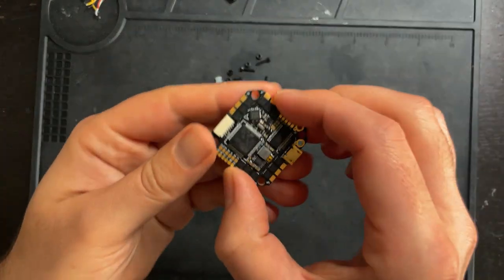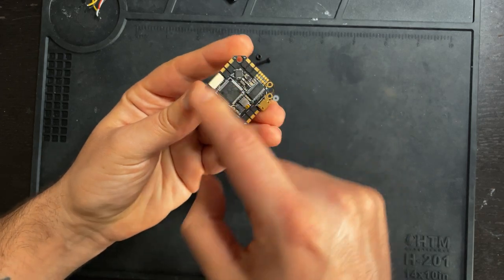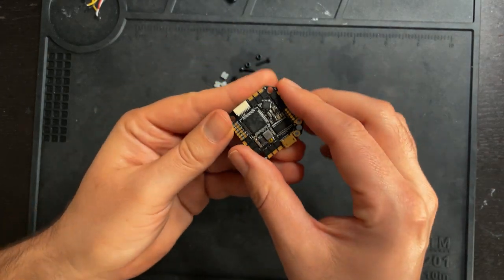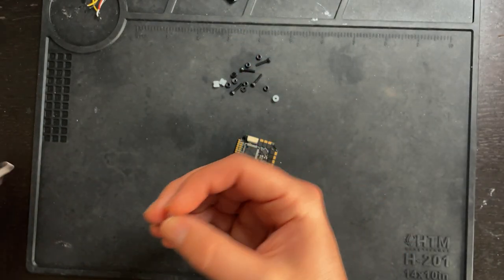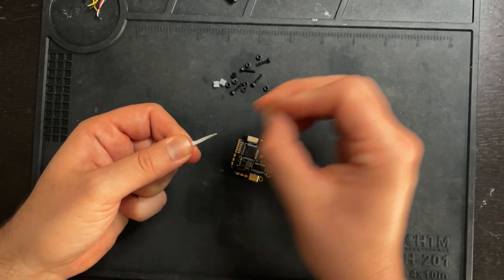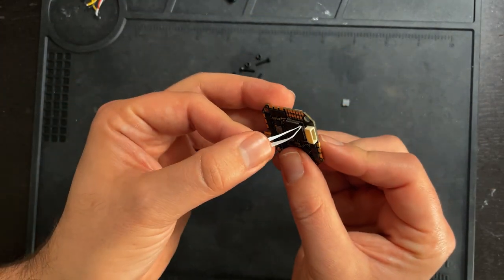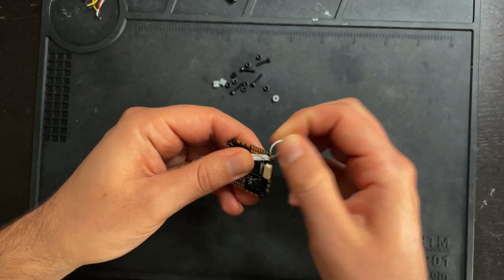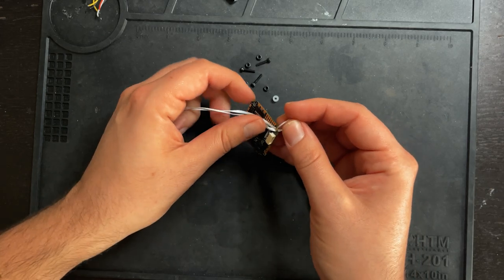First thing we'll do with the flight controller is get these little rubber grommets installed and do these three. Don't do this one yet because we're gonna solder the XT60 on here next. Little trick, I'm sure most of my subscribers know this by now because I include this on every build I do. Take some dental floss, put it through the hole, and this just makes it 100 times easier to get these grommets through.